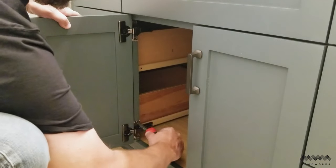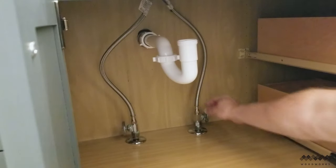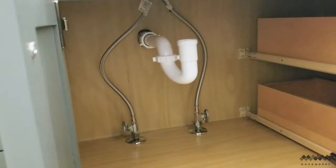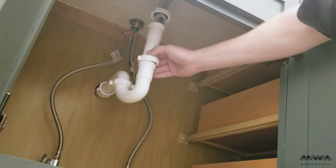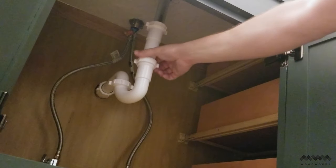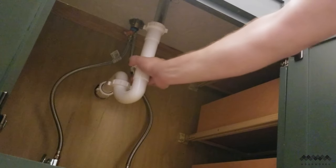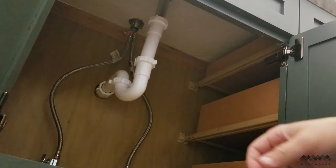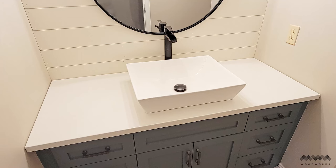I then just needed to pop on the doors. With all the new stuff in place, the last thing I need to do is reconnect the water lines to the new faucet and connect the drain back up to the P-trap. Because I installed a vessel sink instead of a built-in sink, I needed to add an extension piece from the home center for just a couple of bucks — the vessel sink sits higher than the old built-in sink, so the distance to the P-trap is bigger. With that, this vanity makeover is complete.